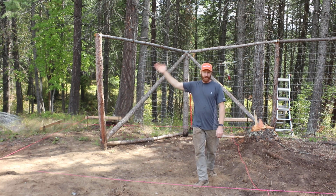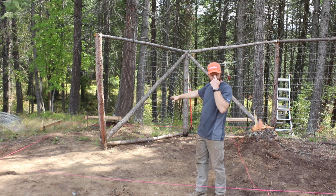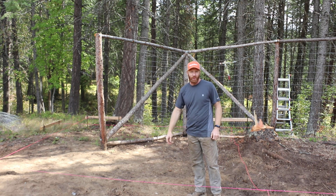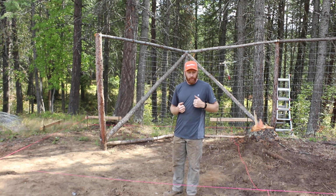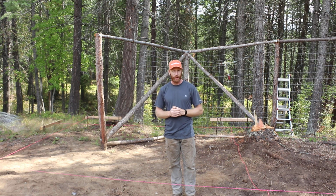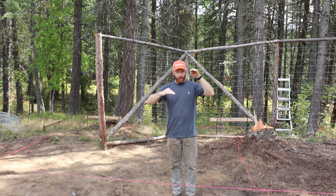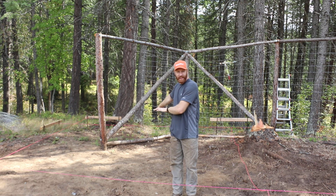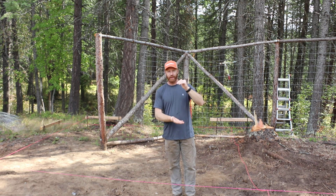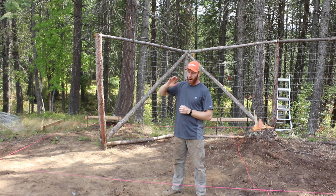When we took the trees down, they kind of swiped it, so we can unbolt it, take the 3 horizontal pieces out, and then we'll just pull the vertical post out with the farm jack and a chain at the base. Then comes the most miserable and or exciting part. We dig holes for those pier blocks, get them relatively level, each one individually. I'm not worried about height. I just want a set height at one corner, and then everything else can cascade downhill or be lower than that, because we'll actually cut posts to the correct height. But we'll work on that today, and then hopefully we can get into actually building the floor.